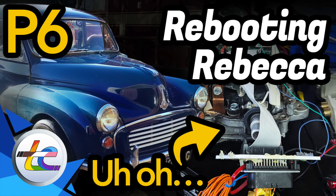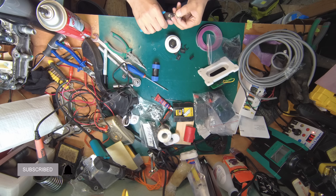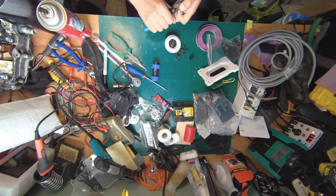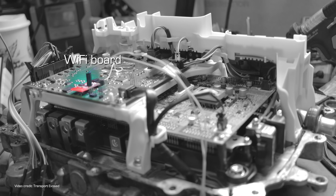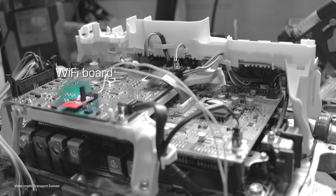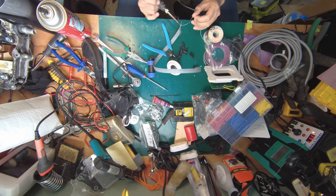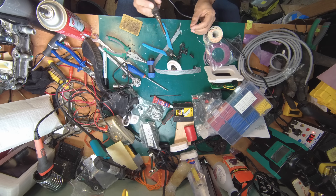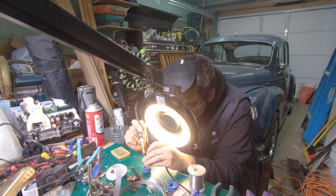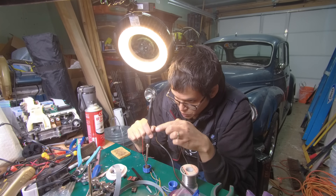My garage has been somewhat reorganized to be a little bit better. The thing I was doing here is creating a cable to take the WiFi adapter board and position it outside the case of the inverter, because unsurprisingly the WiFi adapter board does not work particularly well when completely surrounded by the metal casing. Doing that requires making this little extension lead which carries the connections outside the case. I also created a little connector that lives in the blanking plate on the side of the inverter — a blanking plate we don't use for anything else — which seemed like a good way to get the WiFi adapter outside the box.